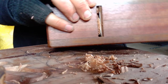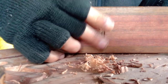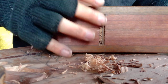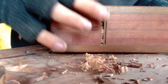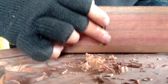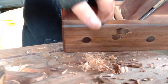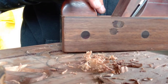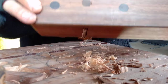The mouth has been opened up to seven millimetres. They talk about tear-out but I couldn't care about tear-out. Opening it up to seven mil just allows it not to get clogged so easily. Also, the front of the mouth — I've tried to scoop out material from the inside so that when it fills up it's just not going to get clogged as quickly. I made this hand plane out of scrap wood.